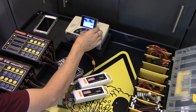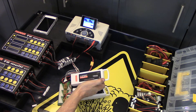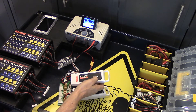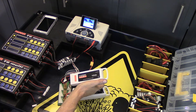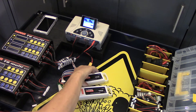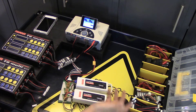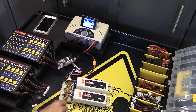It's close enough to 1C to what the pack's rated at. I've read that these packs actually have another sticker underneath that says they're at 6200 or 6400 milliamps instead of the 5400 — but for whatever reason, maybe they were a little bit overrated. Anyway, I charge them at 6 amps each, so that's 12 amps together on a parallel board.